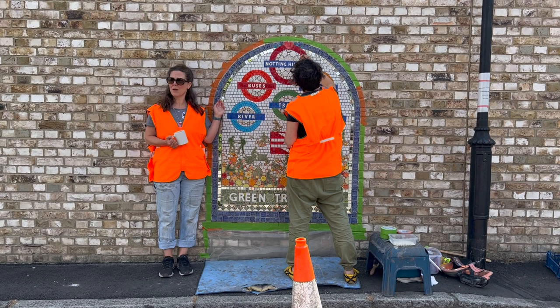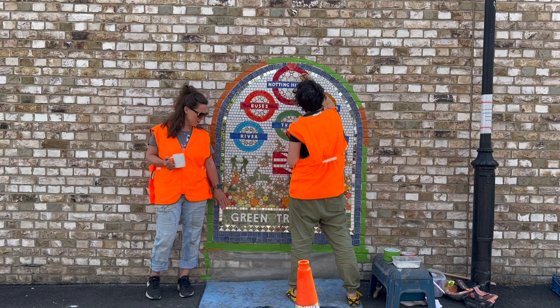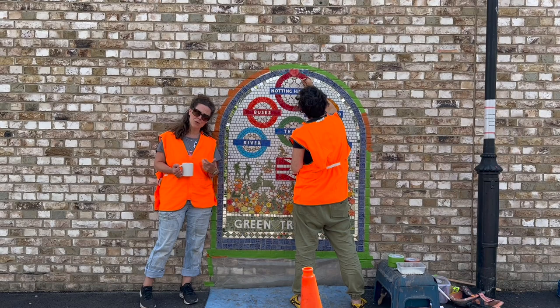It's halfway — we've got it up with cement adhesive and we're just waiting for the cement to go off. That's set enough so we can grout it. We've protected the wall by taping all the way round it, and we're just picking out all the bits of adhesive that are proud so that when the grout goes on we won't have any adhesive poking through.